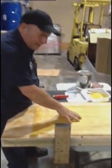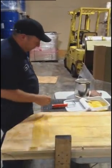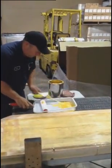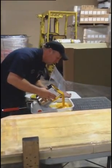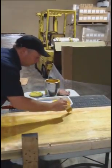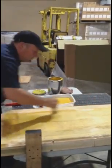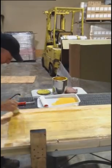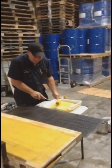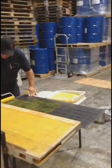Okay, now that our base coat on our kickback is dried thoroughly, we're ready to put on our final coats of Ballz wall adhesive. What you want to do is pour some more into your paint pan. You want to paint around the edges again real quick, just to get that second coat so you're not overflowing. You want to get another generous amount on your adhesive roller and coat your Ballz wall kickback right. Nice generous coat on there.